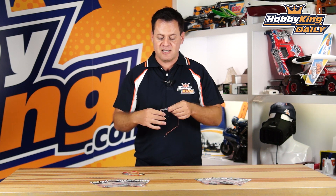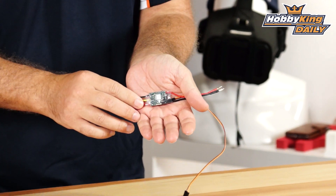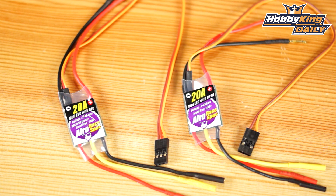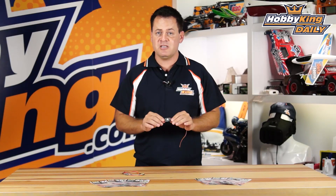This is a true 20 Amp rating ESC. However, the size and form factor — if we get a little shot on it — is actually the same size as our current 12 Amp V3 Afro. We're able to get 20 Amps out of it using a four-layer PCB board. We got enough copper in there to dissipate the heat, move the current, and keep the size small using that four-layer copper board.